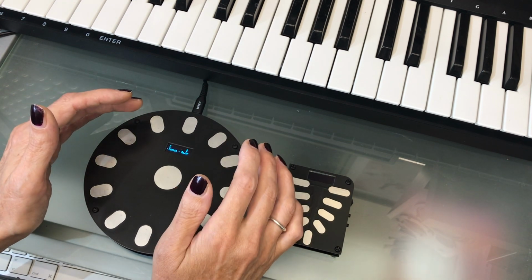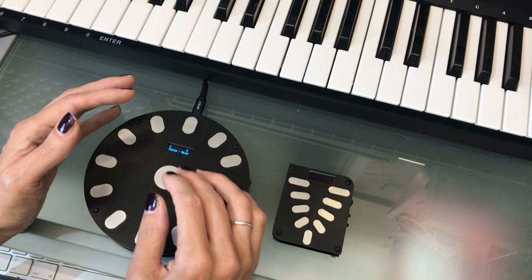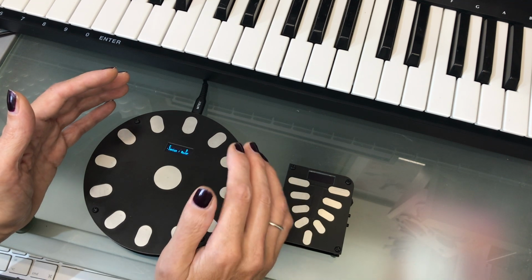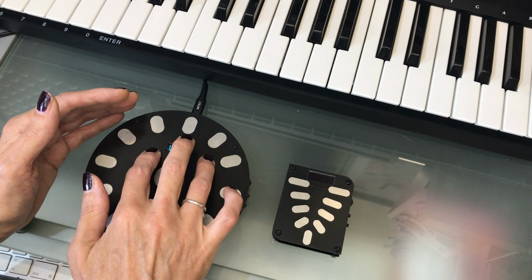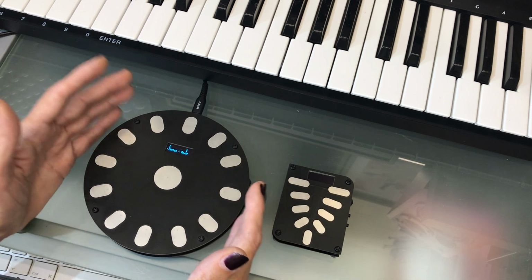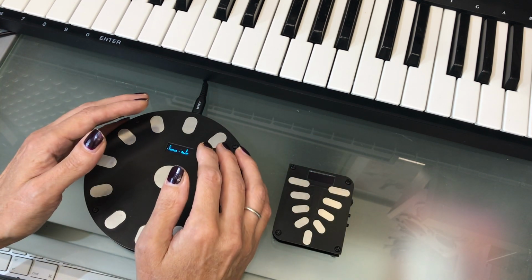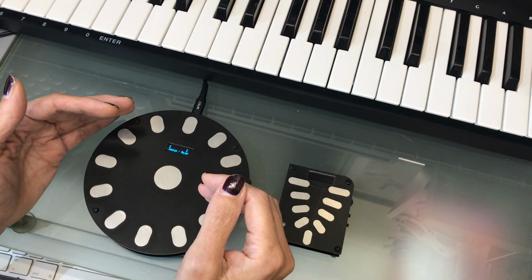Here are the problems. The raw data from the pads are well out of balance. Two are connected together, changing the values from those ones quite radically. But there are other subtle factors too, such as track length, that affect the readings dramatically. So there's a table of values hard-coded in that compensates. One complication of that is that I've already had one hardware revision which changes that balance, and there's another revision on the way, so already providing the right firmware updates to the right people is becoming complicated.